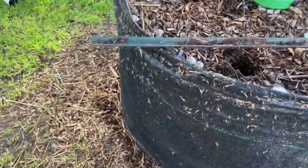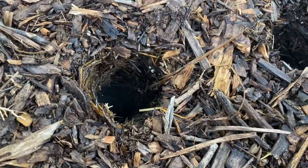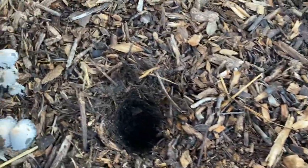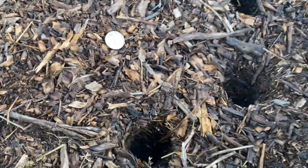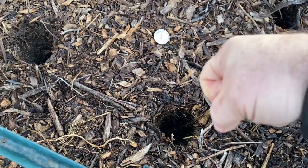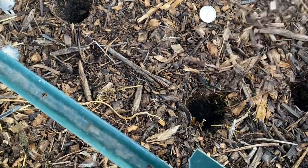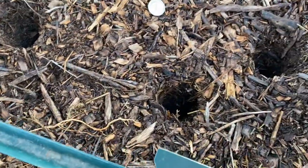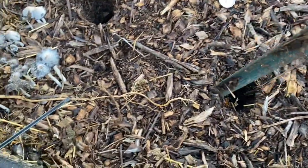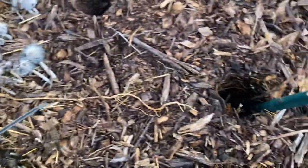You might ask how I do that. Here's a hole that was added, and there's a hole that came from the pipe — not much different. What I did is I took a 2-inch bulb auger that has about a 30-inch reach, and I went all the way to the bottom up and down with it a couple times. Of course it's not going to stay nice and open, so then you take something like a T-post and you just kind of do this with it.